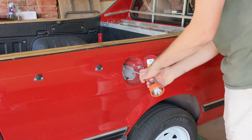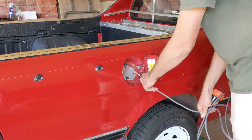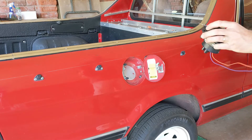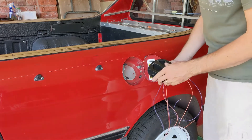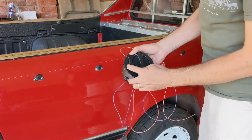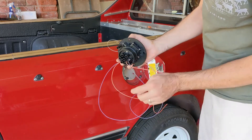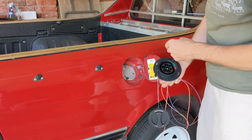Here's the existing plug that can come out now. What I need to do is to put this in here. I'm hoping it will fit — I'm not absolutely sure. What I've come up with is that I'll put it in from behind. This looks like it should go in from the front with those countersunk holes there, but it's not exactly round at the back, so I don't really know that that is the way to do it. So what I'm going to do is to drill an 83mm hole in here.